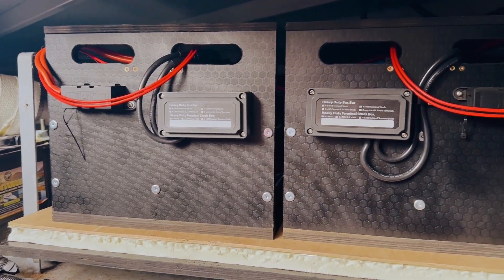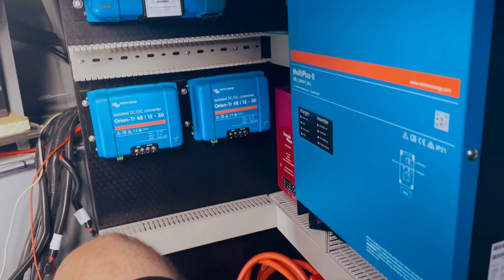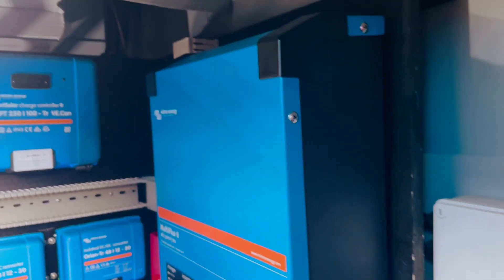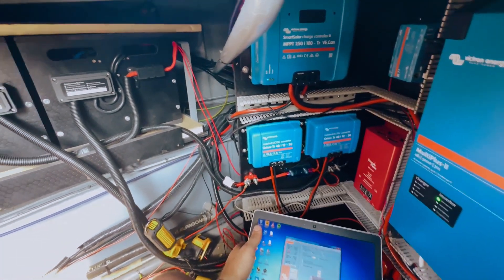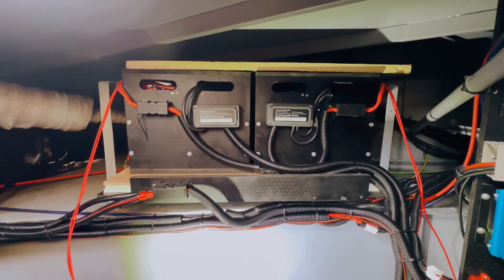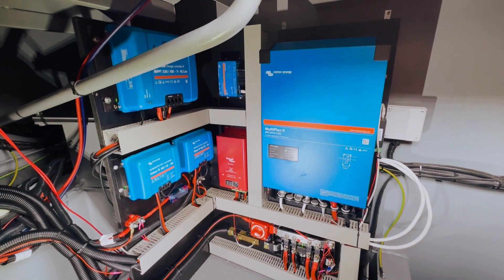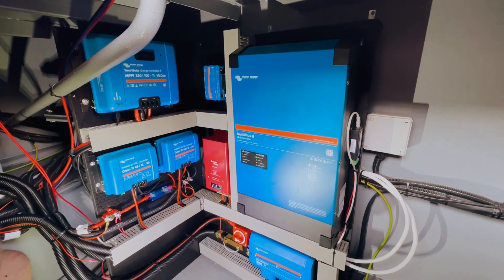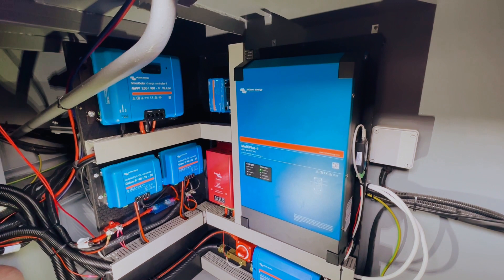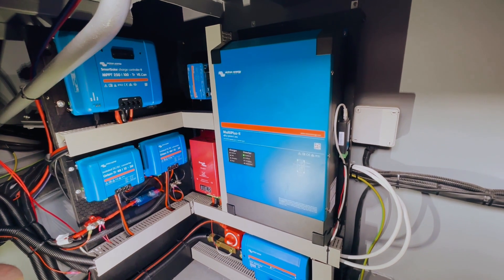We paired the four kilowatts of solar with about 26 kilowatt-hours of lithium battery storage. We built two big 48-volt battery systems and put in a full Victron system. Most of the boat's electrics — lights, USB, water pump — run off 12 volts, as it originally had a 12-volt system. The customers need the ability to live on this boat all year round, which is why there's such a substantial solar and battery storage system, with step-down converters for the 12-volt systems.